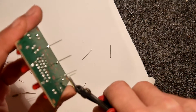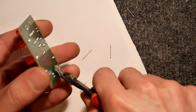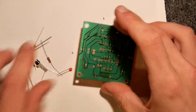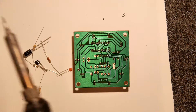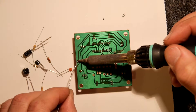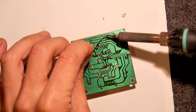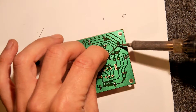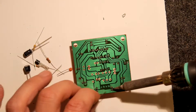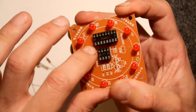I have to admit over the years I've never worn safety glasses doing this, but I don't advise that - you can kind of direct the clippings. Don't throw the legs away - legs are really useful because you never know when you need to make a jumper or a link for something. Now find the tack legs and retouch those. If you're a stickler for finessing you can go over all the other pins too to get it real nice. That's all our LEDs in place, lovely and firm.